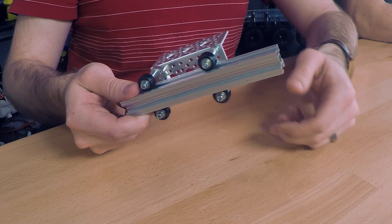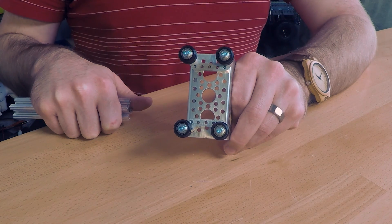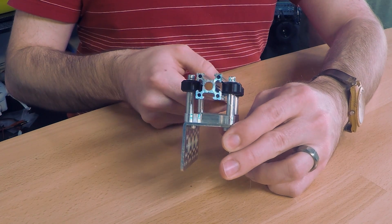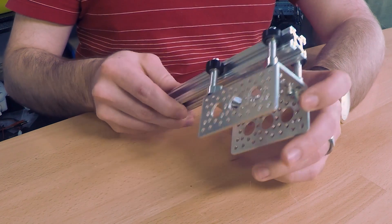Finally, we're going to talk about V wheels and our new mini V wheels. The V wheels, when used in conjunction with the X-Rail, make a nice support mechanism for a linear motion setup. Our standard V wheels are held a set distance apart using the X-Rail V wheel brackets. The brackets are required to hold the V wheels a set distance apart so that the X-Rail will slide down through the V wheels with no slop between the wheel and the chamfer of the X-Rail.